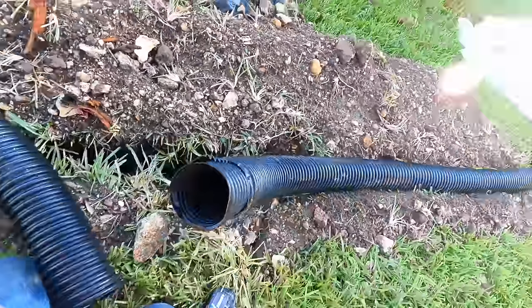On this side of the house we ended it with a huge grate — not a catch basin, just a large grate and a piece of six-inch pipe that lets water come up and out of the line. You can see the trench goes all the way back — 280 feet of pipe, and boy does it work. You can see the markings here for gas and electric — we had to cross over those with a lot of hand digging, and of course there's irrigation in here as well. We did hit a couple of sprinkler lines and made those repairs.